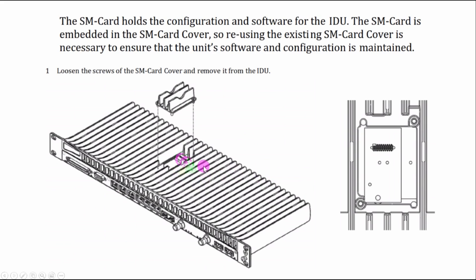You should always keep a backup in your laptop, because the same parameters — same VLANs, same IP — you need to fill into the new IP20G as well. If the SM card is working with the new IP20G, then there is no need to do manual commissioning with the new IDU.